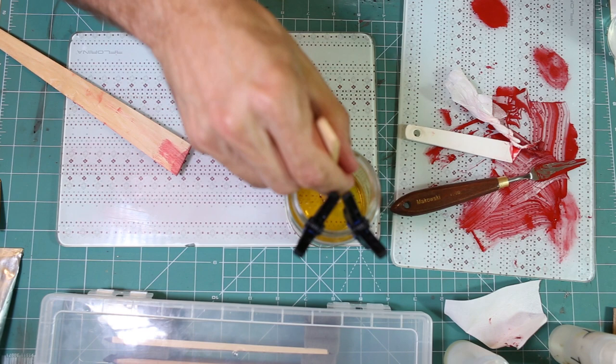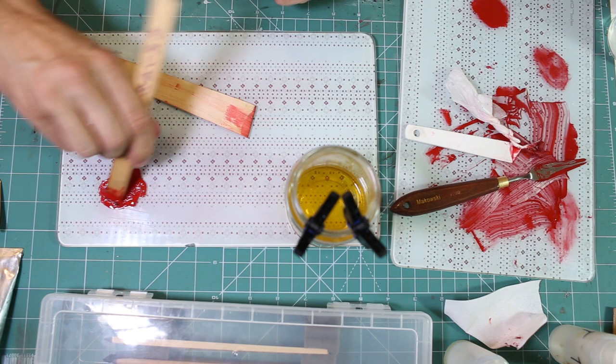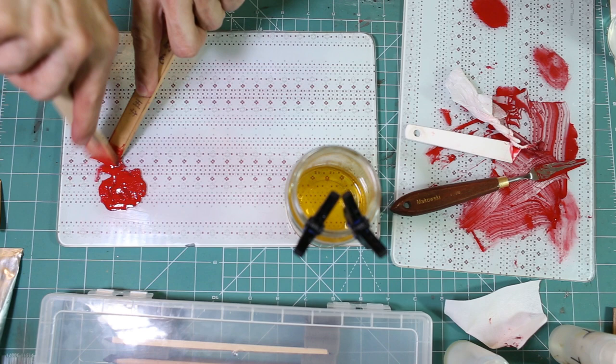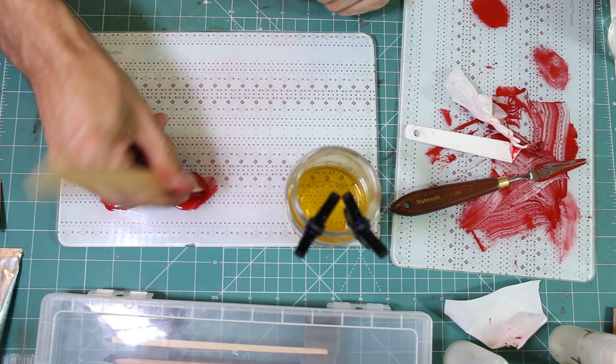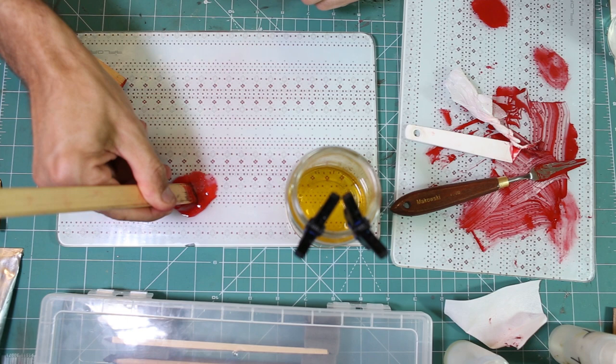Usually I lacquer much more, but I wanted to show you how to do this. You have to clean the brush again. You clean the brush with oil — in this case rapeseed oil. Dip the hake in oil, work it on the surface for several seconds, then push the oil with Urushi out of the hair with the spatula and repeat. You have to repeat this process up to five times, sometimes more, depending on the type of lacquer. Usually heavily pigmented lacquers take much more work, while pure lacquers like Kijiro or Nakanuri are much easier to clean.